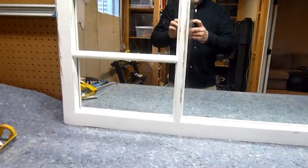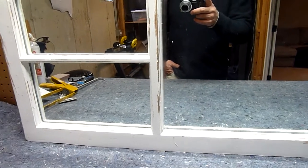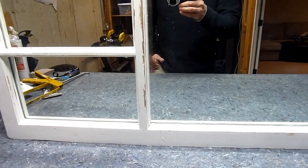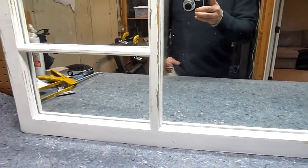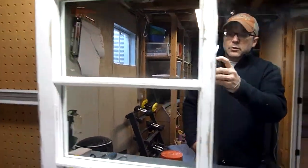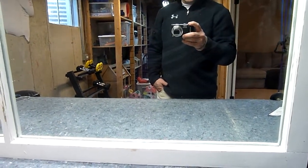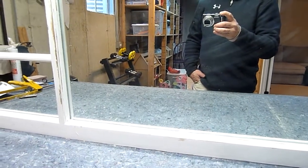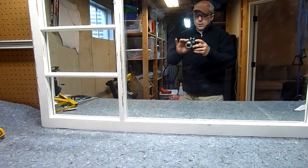One thing to consider when you're buying these old window frames is that they'll very often have lead paint on them, and that was the case with this one. So I completely removed all the paint with a stripping compound. I didn't sand it because I didn't want to create lead dust in the air. I used a chemical compound and stripped it down, then just went to the paint store and got some paint to match my daughter's furniture. Then I sanded a little bit on the edges to give it a bit of an aged or vintage look — that's your choice whether you do that or not. With older frames it's probably a good idea because you're not going to get a perfect finish anyway; most likely it'll be dinged up or have multiple coats of paint on it. I think it turned out pretty good for a first time, and I look forward to the next project. Thanks for watching.